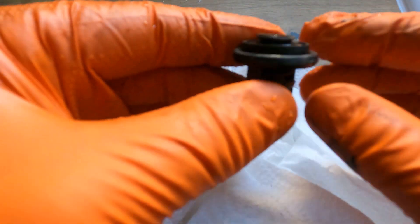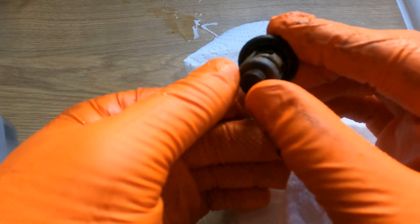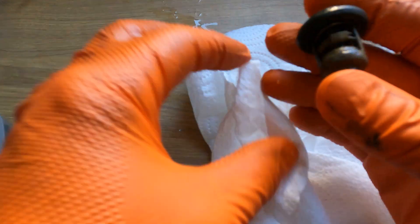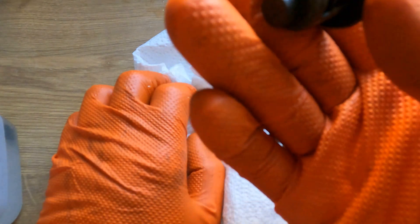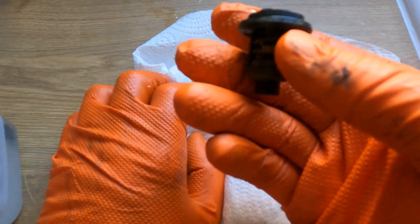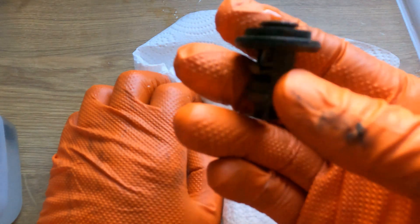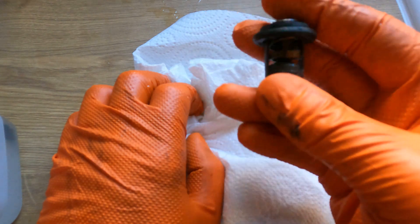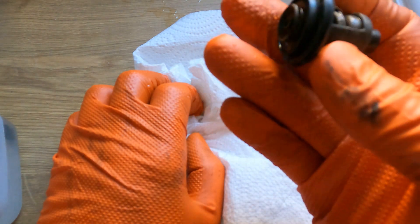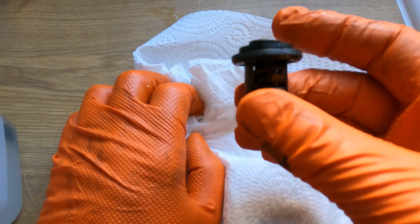With this thermostat I've run it under cold water and it's still open. I've cleaned it off as best I can but it's still protruding and still open. You can see from behind there's daylight down the bottom corners here. So this thermostat will have to be replaced and I'll get a new gasket for it at the same time. I just can't take the risk putting a thermostat in like this.